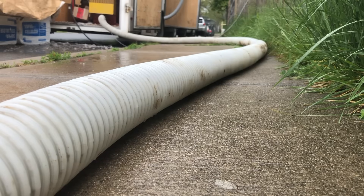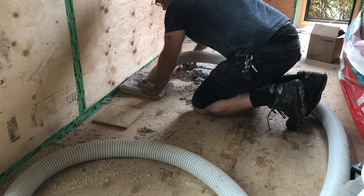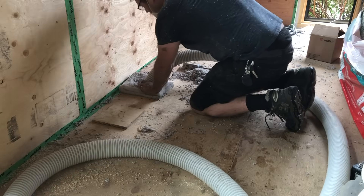For insulation on the inside of the walls I used cellulose — a total no-brainer. It's made from post-industrially recycled newspaper. I packed it in densely so there's no cutting; it fits perfectly into the cavities. It also helps regulate indoor climate by absorbing moisture when humidity is higher and releasing it when it's drier.